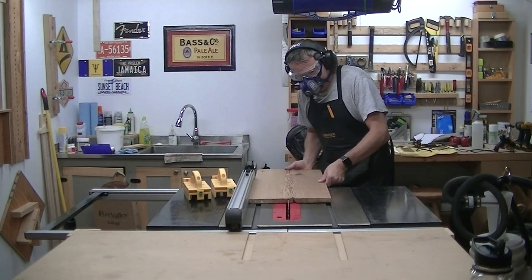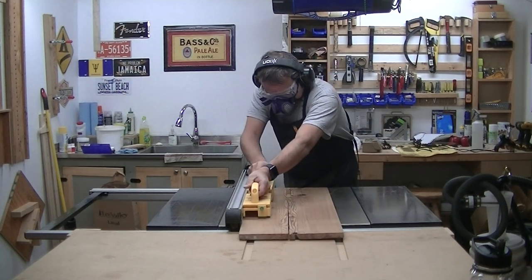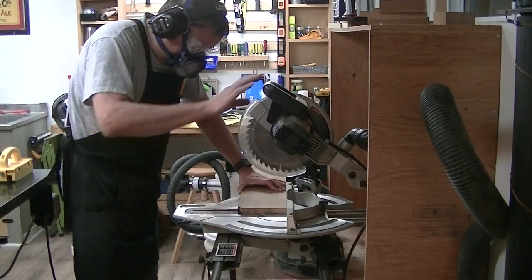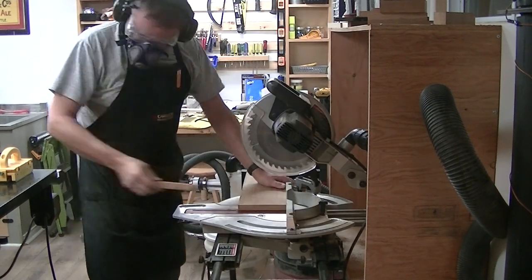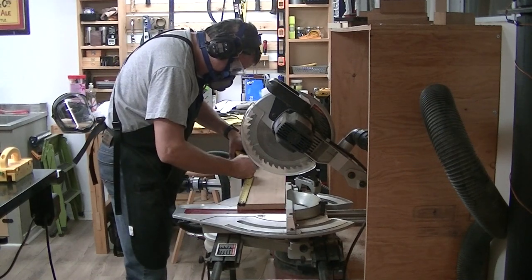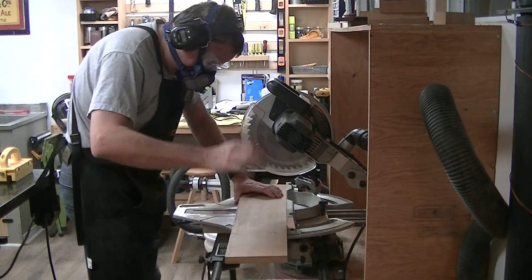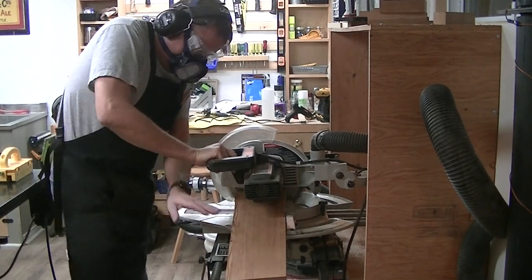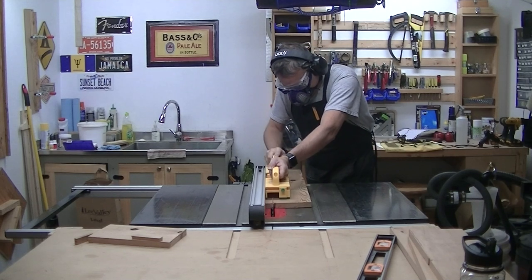A couple of years ago, I built a coffee table for our living room made out of reclaimed barn wood. That's what I'm going to use for this project. I had enough left over for the following pieces: a 29 inch long by 6 inch wide base, two sides that are 18 inches high and 6 inches wide, and two pieces that are 29 inches long and 1 inch wide. One is going to be used to hang the rack on the wall, and the other is going to cradle the tools.